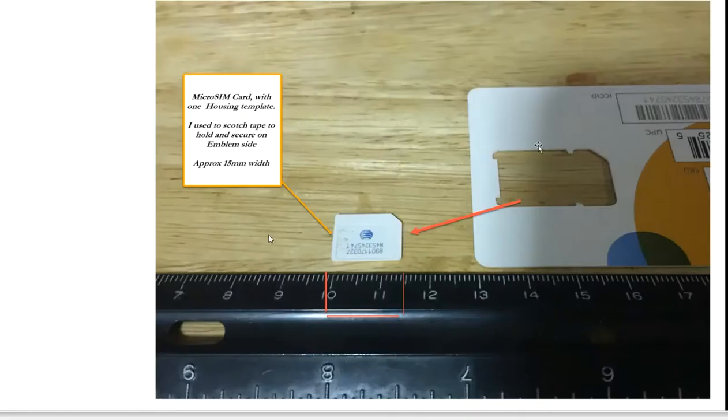We ordered this card from SmartConnect and popped it out of the credit card format. This card is all white — that way we know it's SmartConnect. It has the AT&T emblem and says AT&T. What's really important is there's one little ring that we've got to snap on, and that makes it big enough to fit into the GS18. It's around 15 millimeters long. This is very important — otherwise it could slide in and get lost in the GS18. Make sure you have that first ring snapped.